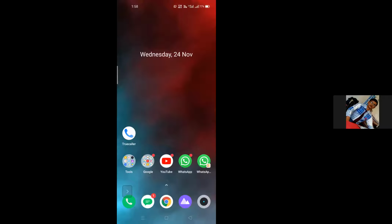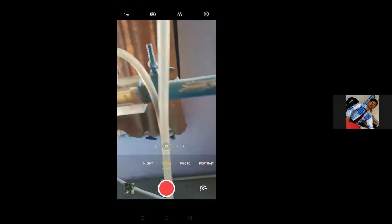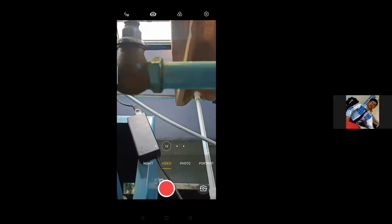I will do that, and after having a sufficient discharge inside this pipe, there is another valve here you can open completely. This can be used to control the discharge inside this Venturimeter also. There is another valve for the lower pipe, which should be closed because if water simultaneously comes through this valve, then whatever discharge we get here in this measuring tank will be wrong. So this valve should be kept closed, and only this valve should be open.